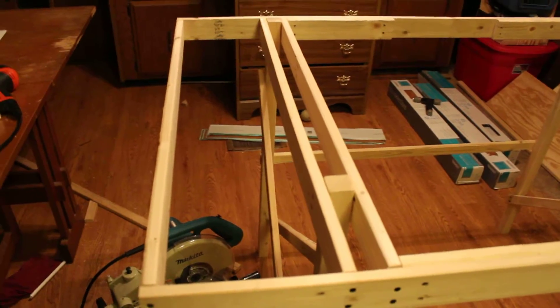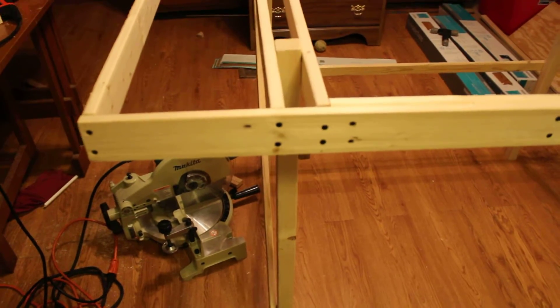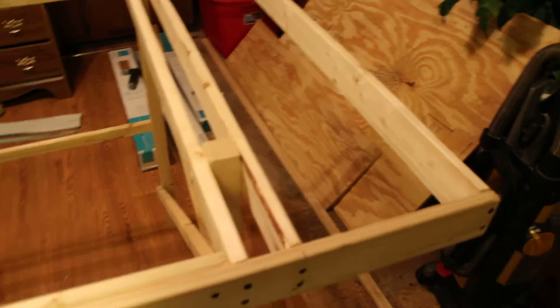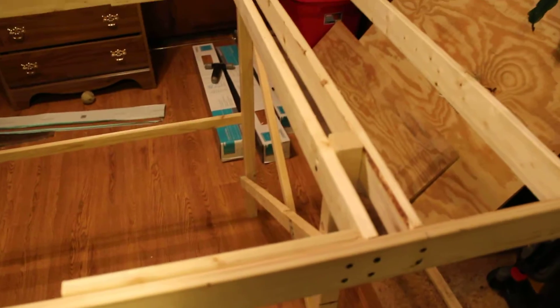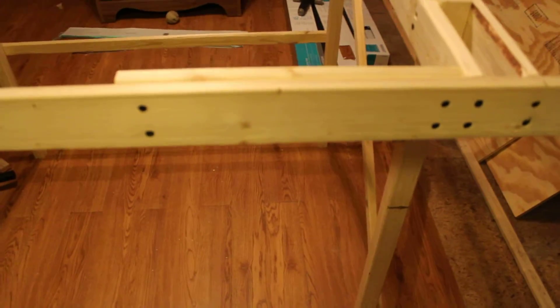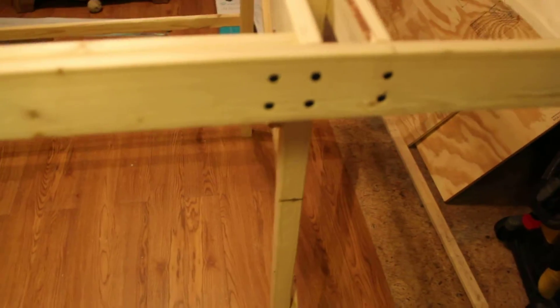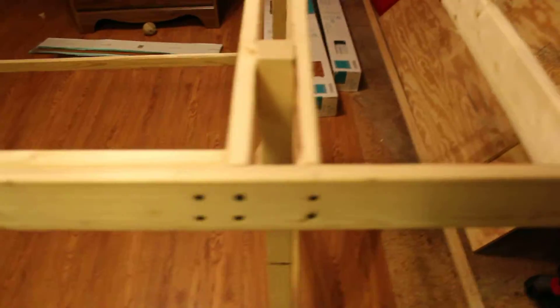I've gone out and purchased some lumber after doing a lot of research online. I'm laying a new floor in the front dining room, so I'm just going to use this for my work area for now. I've gotten a bunch of one-by-threes — this is a five-by-three foot bench I'm making for a five-by-three foot layout. For lumber I have one-by-threes, two-by-twos for the legs, one-by-twos for the support work, and one-and-five-eighths inch wood screws.